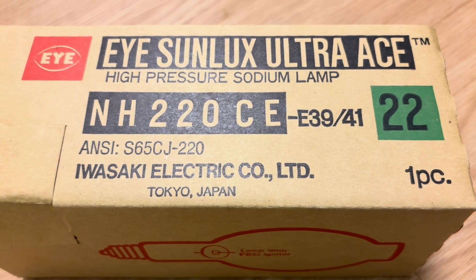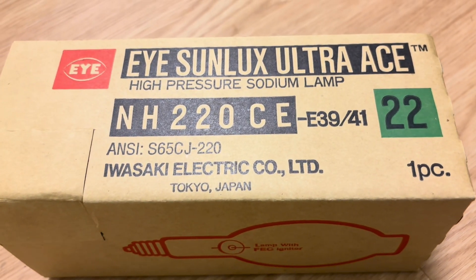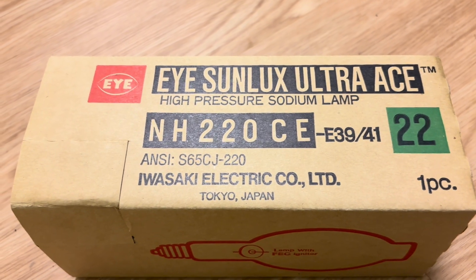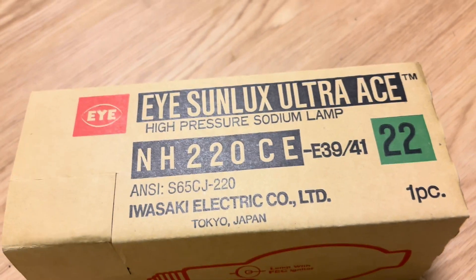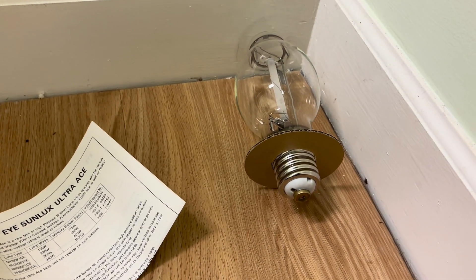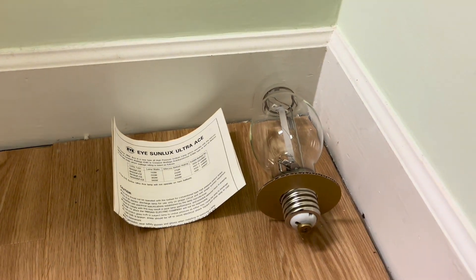The LC and CE suffix versions are the key ones — the CE suffix lamps are the only ones that'll work on metal halide ballasts. I had quite a hard time finding these. These and the Philips Retrolux lamps will work on CWA ballasts. There's also some cautions in the pamphlet. Let's take it outside and test it.